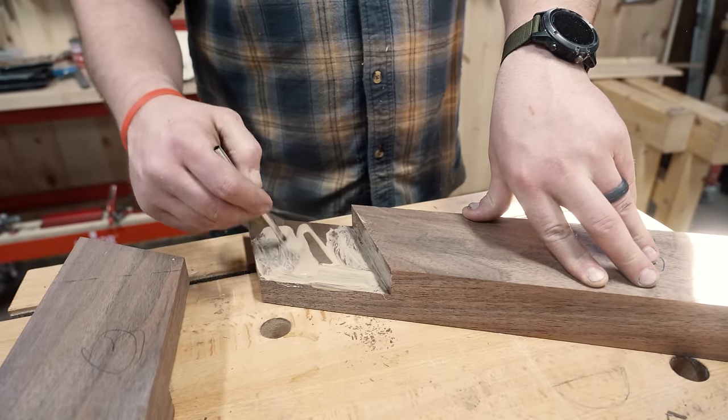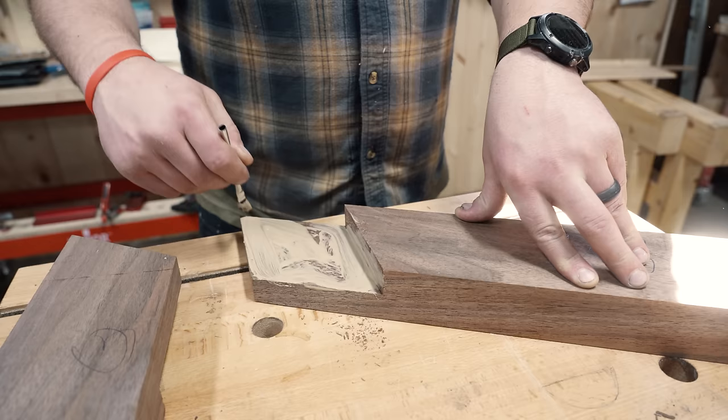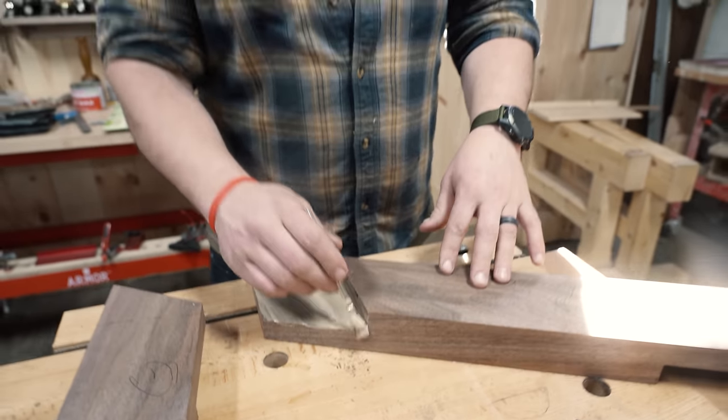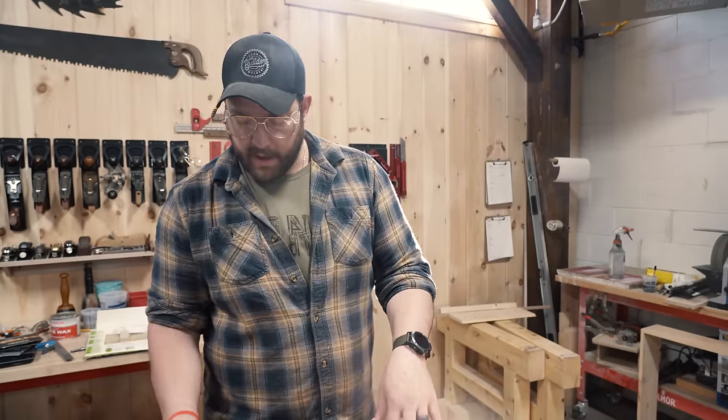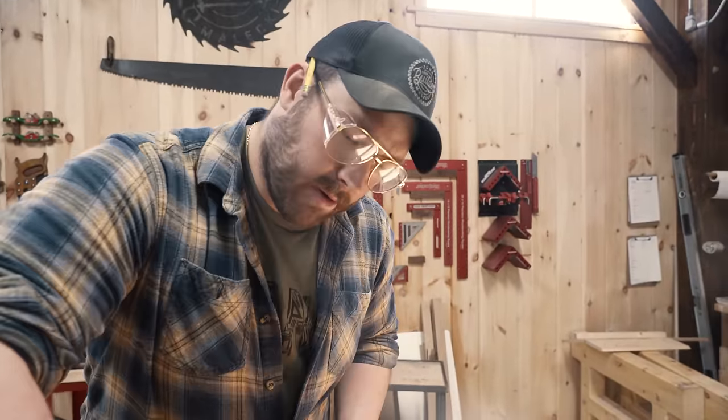The nice part about a lap joint on these angles is that I only have to put vertical pressure. I don't really need to band them together like if it was something round. That probably makes absolutely no sense to anybody. But don't worry about my blabbering, just glue.